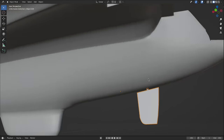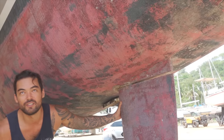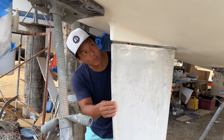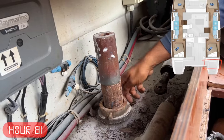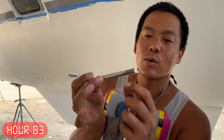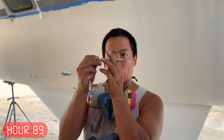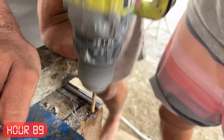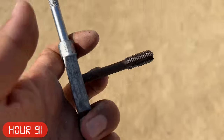The most ridiculous snowball effect started from a comment Colin made months ago about our rudder bearings — the shaft is meant to spin on the bearing, and on anchor in rough conditions you might hear that knocking all night. To fix the bearings we had to remove the rudder, but the rudder post bracket was rusted so bad that we broke three bolts taking it apart. Then I broke the dowel pin that literally holds the rudder in the boat. Miraculously, a furniture store in the city sold a cabinet handle with the exact same size. We drilled the ends for cotter pins and broke three bits — even made fire — before getting through. Meanwhile, Mary got the welder to drill out the broken bolts, but the holes were so corroded I had to hunt down a tap and recut the thread.